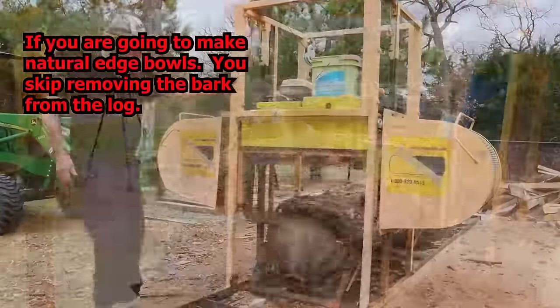This was what I was trying to explain about the anchor seal. After I put the anchor seal on there, you wait a few days and look at this same piece, how all the cracks closed up on it as you slowed down the drying process and quit letting it crack on the outside surface. Make it dry evenly, and the anchor seal will help you do that, or greenwood sealer. So very effective about not ruining your bowl blanks by dry cracking. All right, this is the third time around for these 22 bowl blanks out of our first slab that we processed.